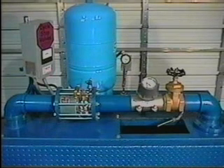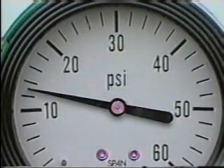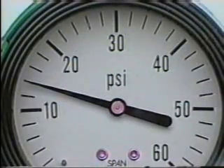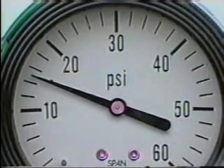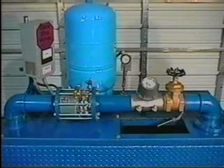When there is no more water being used, the 5 GPM forced through the CycleStop Valve has no place left to go except into the small pressure tank. Then 5 GPM is the rate that we fill the tank, even though this is a 500 GPM pump. As the tank slowly fills to 15 PSI, the flow is so low that the check valve has only opened the thickness of a piece of paper. As the pressure switch shuts off the pump at 15 PSI, there is no water hammer when the check valve closes. The CycleStop Valve also absorbs the water hammer when the pump is again called on to start.